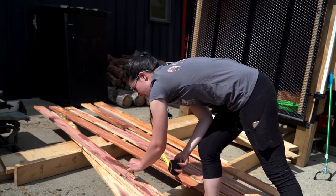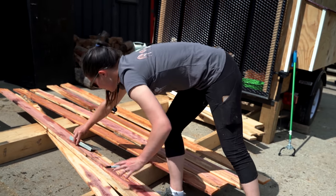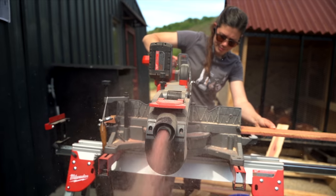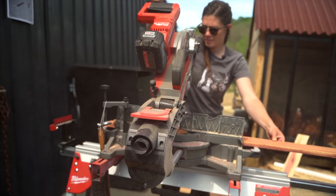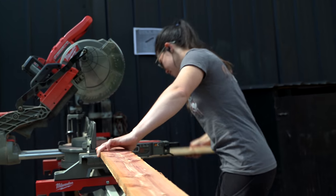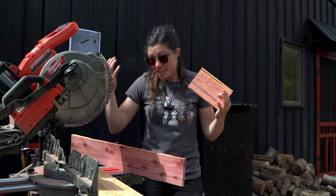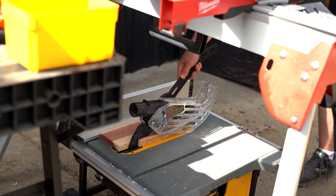There's another little inclusion here that is just a little ugly, so I'm going to go ahead and cut that out as well, but still get plenty of usable lumber. One little trick when you're using rough sawn lumber to get the most out of your wood is to take your smallest piece and size all of the rest of your wood to that smallest piece.